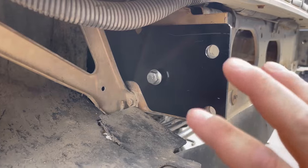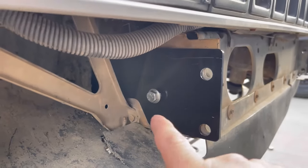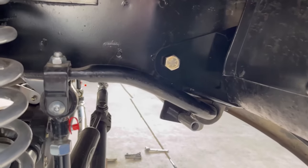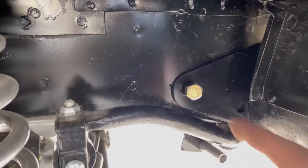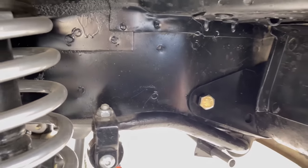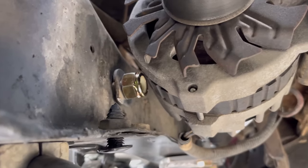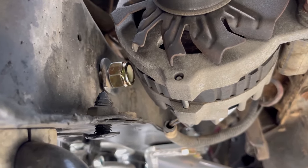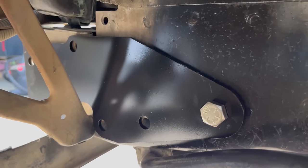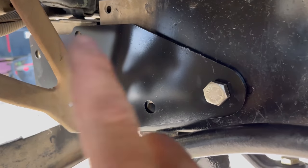The three holes is the pattern for the bumper. I just held this bolt in there to keep it loose — we're going to have to take that back off when we bolt the finished bumper. On the other side I have the tie-in bracket, and this is the bolt that goes through the frame for added rigidity. I'll give you all the dimensions and hardware sizes in the description box below — it had to be a specific length on this side because of the alternator.